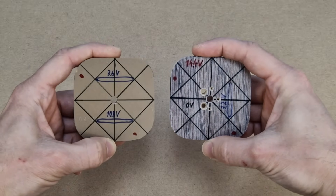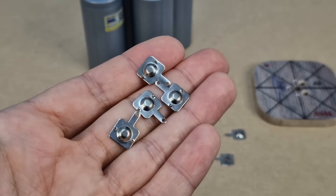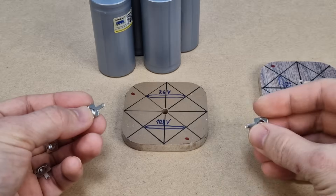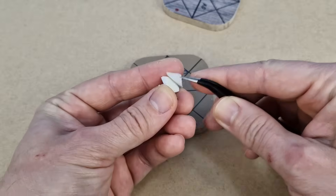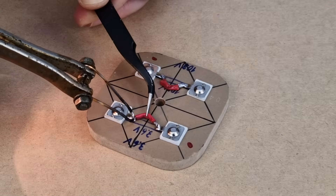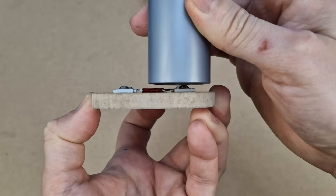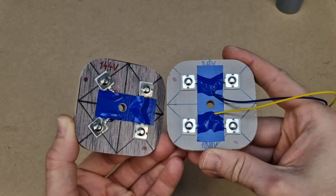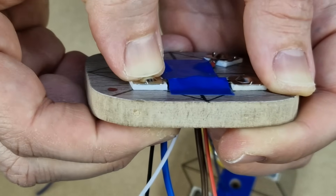So back to the laminated boards again. I measured and cut 2 pieces — they will hold the cells together. I will use the same battery contact plates, but only the positive pins, no springs. I want to minimize the power losses and the springs are not strong enough for a good contact. The contact plates will be mounted with strong sticky foam tape. These short thick wires will make the series connections inside the battery pack. The foam tape will also help to hold the cells instead of the weak springs.